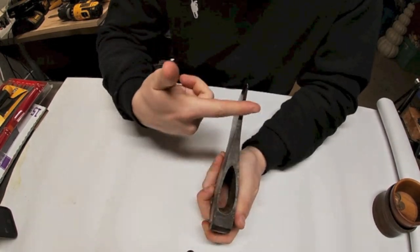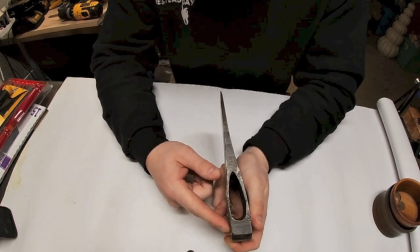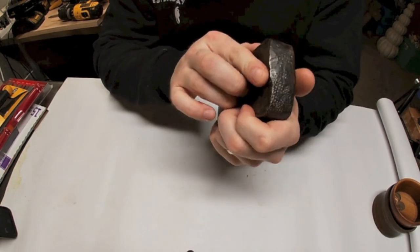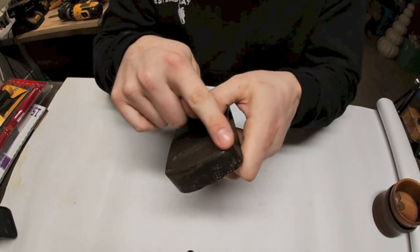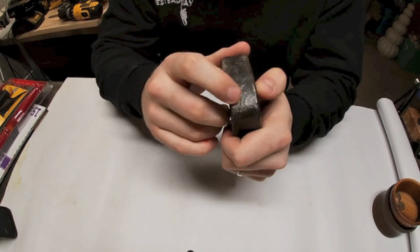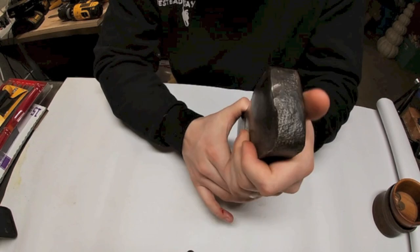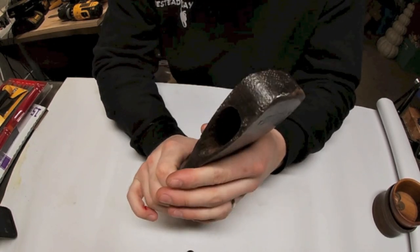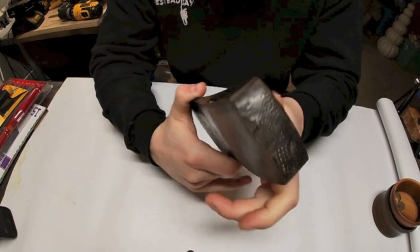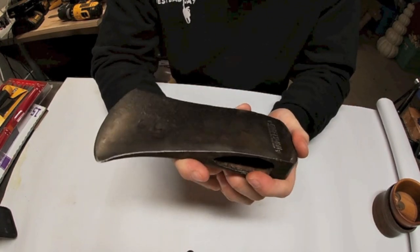When you're buying an axe, you want to get vertical shots like this, because if someone was pounding metal wedges — which they shouldn't be — the head could be off or twisted. There's a little bit of grind work and some mushrooming here. You should never pound metal wedges with a felling axe; use a maul or sledgehammer.